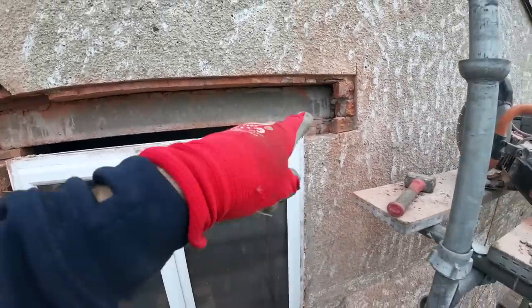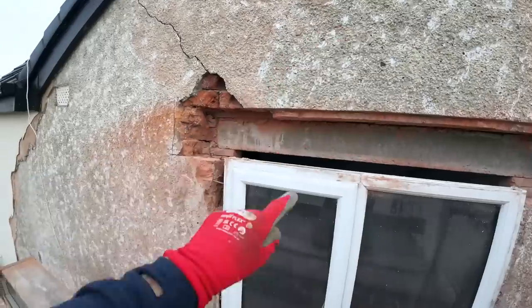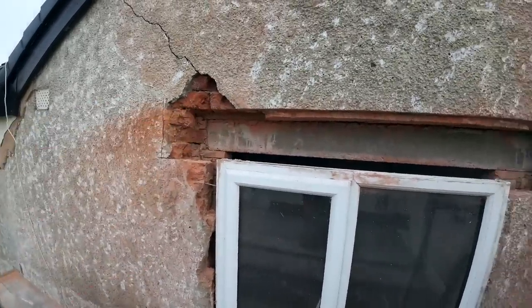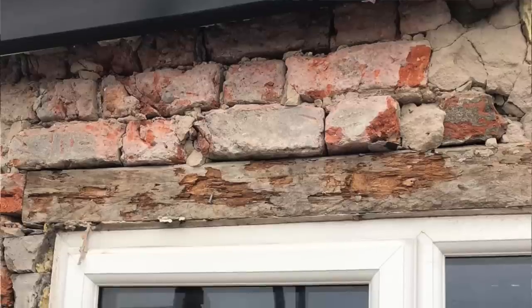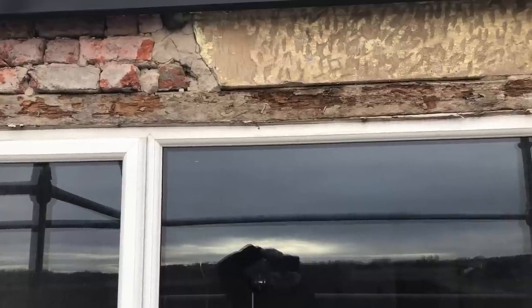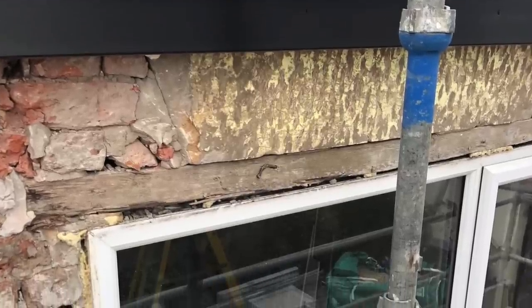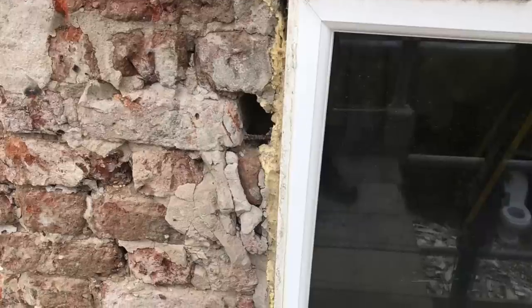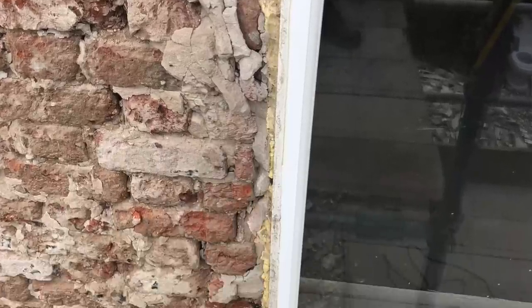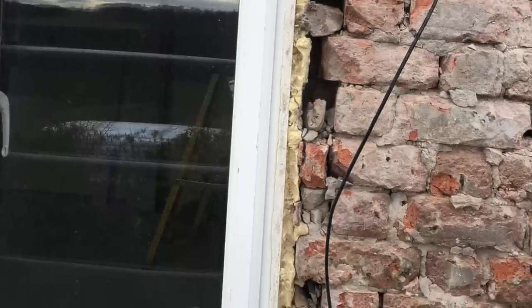So yeah, there's concrete bricks there and the lintel in, and then tuck point it and just put a couple of splits on the top there. And then that's it, that's all steady away. We've got a few to do on this. There's a lot of timber which is rotted behind the render, now the render's off. Each window that happens, in fact I'll put a couple of pictures in as I'm talking here now, so you'll see what we're up against. Next couple are about 2100s, this is a 15. So once Alex has got that mix done, we'll get our commons cut and get this put in. Catch you in a bit.